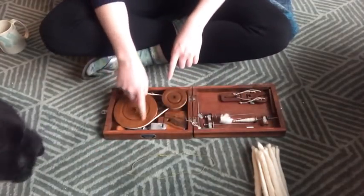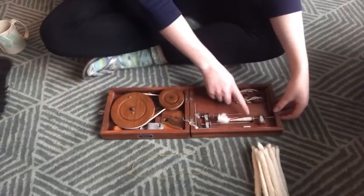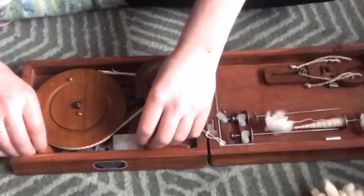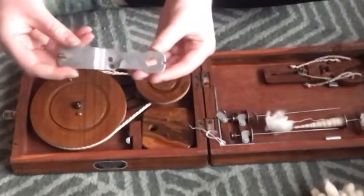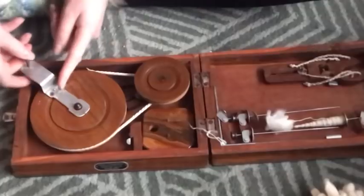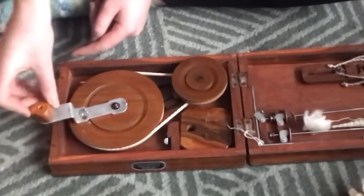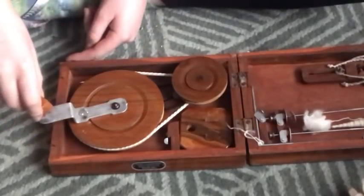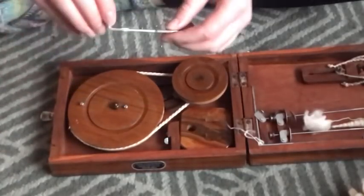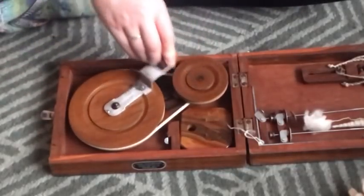So we have a large wheel, a smaller wheel called an accelerator, and then you have your spindle. I have three spindles over here. This is the spindle I've been working on, so I'll start from this side. The large wheel has a little handle — it's an aluminum handle and it attaches on just here. There's a little catch to just attach it in. The handle is a really nice triangular shape for your fingers to hold. Now these are connected, and the handle has an angle on it so that when it swings around to the small wheel, it doesn't hit it. It's really well engineered — I do love it.